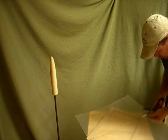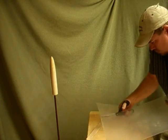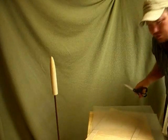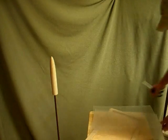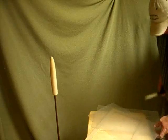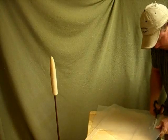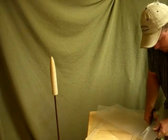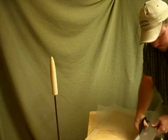There is a thin film that will have to be pulled off both sides of the PETG. I'm going to turn my oven on to 350 degrees. You need to wait until the oven preheats to 350 degrees to get the proper temperature for the plastic, because if you try to put it in there early the plastic will start deforming and it will deform too slow.